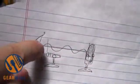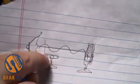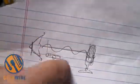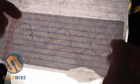As you can see, each microphone is seeing this wave at a different point in its cycle. For the 57 we're seeing the wave at a peak, and for the condenser we're seeing the wave at a valley. Here are our two waveforms as the microphone is seeing it. One is seeing the waveform start at a valley, and one of them is seeing it start at a peak. So what happens is that when these waveforms are summed, these valleys and peaks cancel each other out, and that is how you lose frequency in phasing.